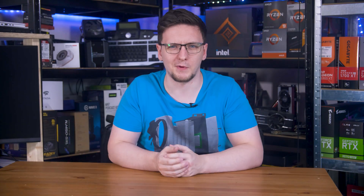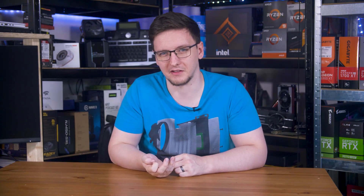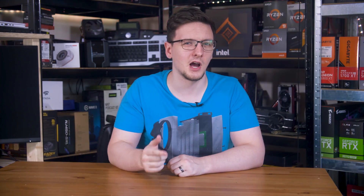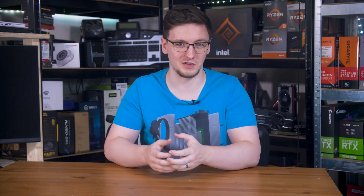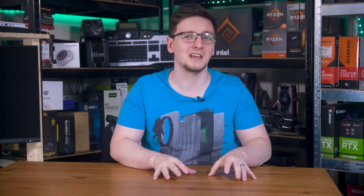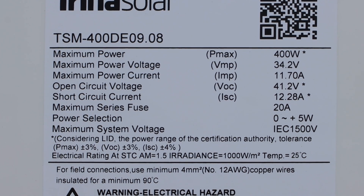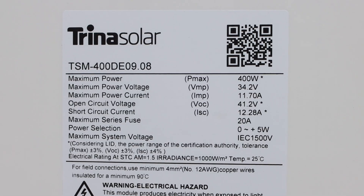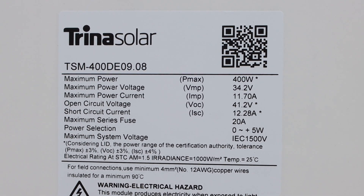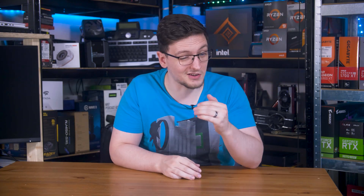On the flip side there are the professional panels. These are massive — like 1.8 by 1 meters each — and are generally only available from wholesalers. Most places in the UK won't sell them directly; they only want to sell to businesses, although I'll leave a link to one place that will sell to individuals in the description below. These panels output anywhere from 200 to 450 watts — mine are 400 watt panels — and surprisingly weren't that much more expensive than the hobbyist options. For a professional installer installation, these are the panels you'll be getting.